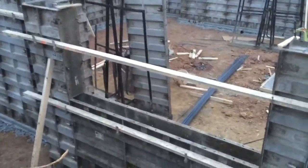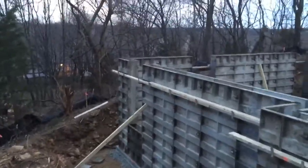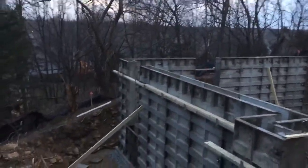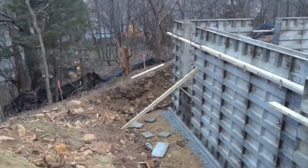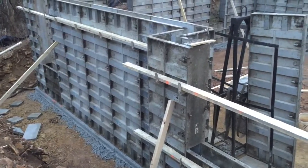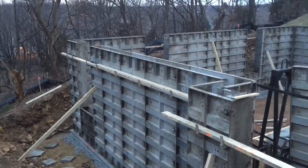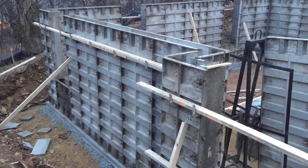We've added a large window here that will be basically at our finished grade when we're done. Our corner windows and window wells into the basement bedrooms all have to be egress-rated, so instead of coming up inside a window well or messing with the site grade, we let the site tell us what we needed to do — where we could get windows in and how our grade would flow. That's definitely not typical for home building in the US today, and it's something I wish happened more often as an architect.